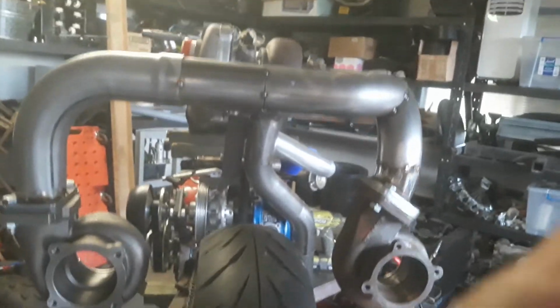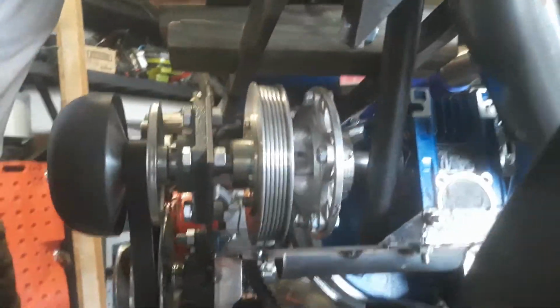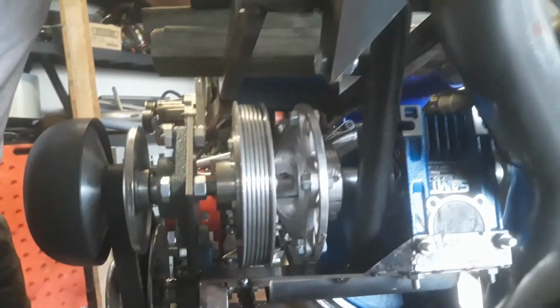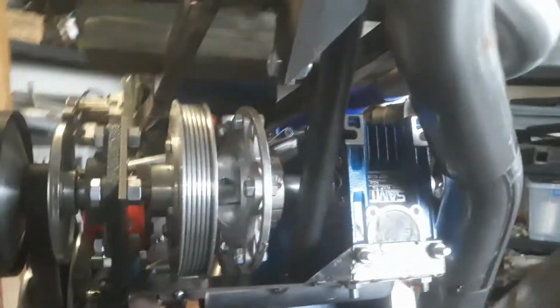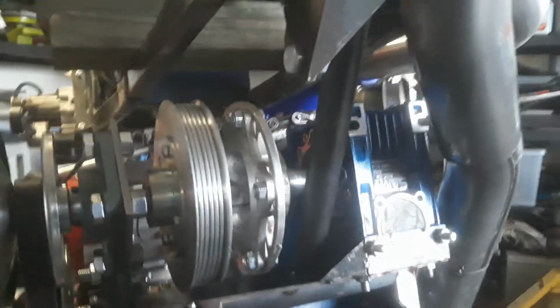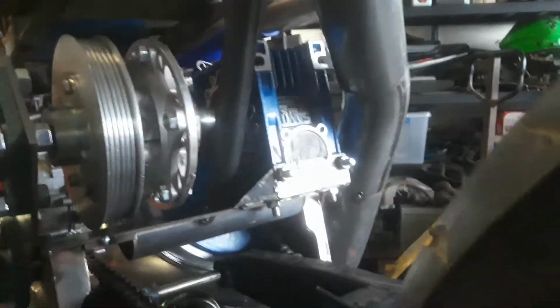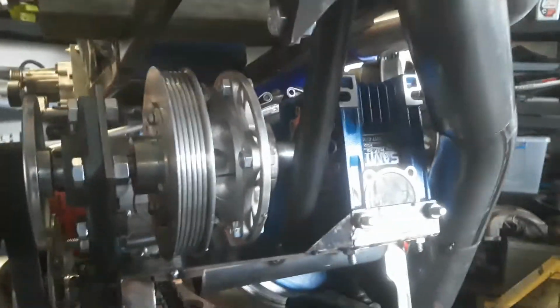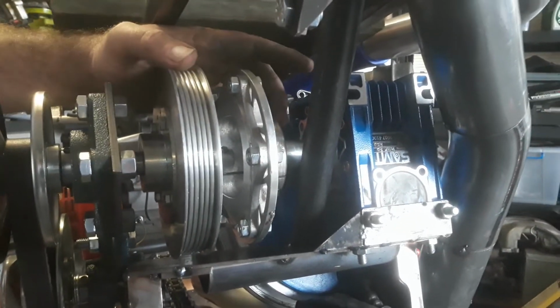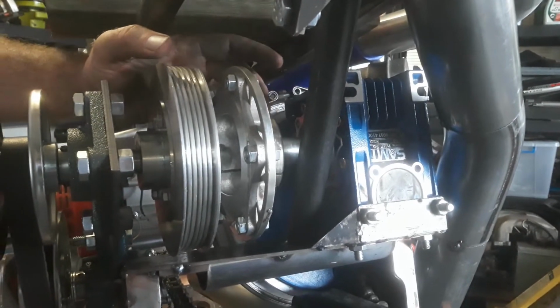You can also kind of see what's going on with the transmission here. I'll show you this again. Episode 2 didn't really show very well, the light coming through kind of overexposed it. But here we have this blue magic box, a worm reduction gearbox. It's a 10-to-1 coming straight off the power turbine, which outputs over to here. Here we have just two sprocket hubs face to face. This one has two sprag clutches in it.